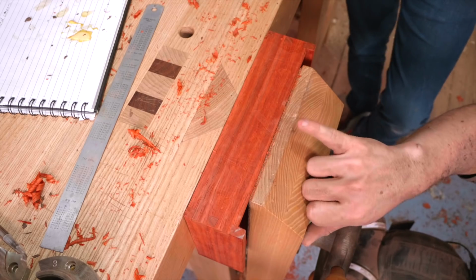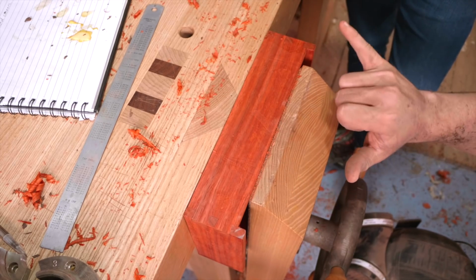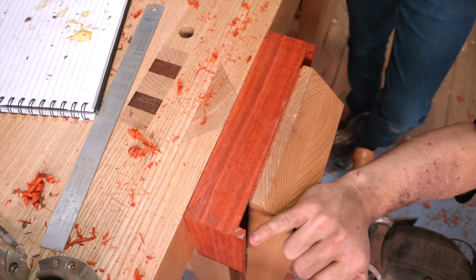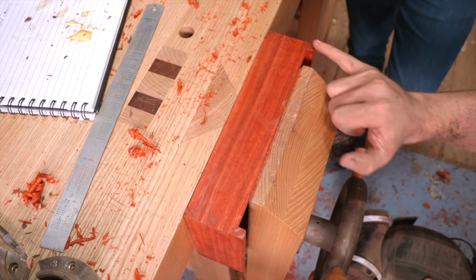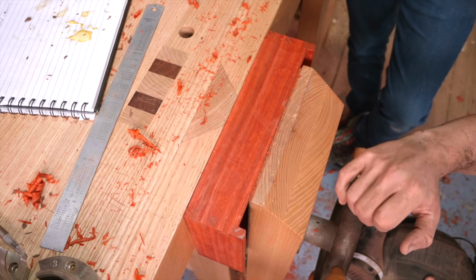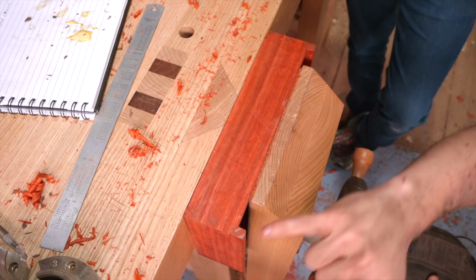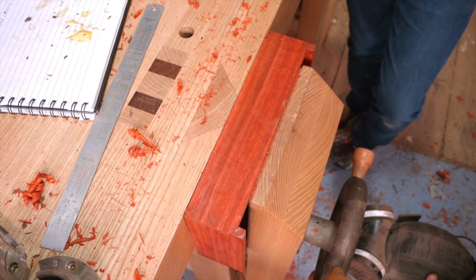If you can't reach the middle of that, it's because there's a high point there or there. Oh, okay. Which means you need to take those down before you get to the middle. If you try and bring the blade out in order to get to that, you end up cutting too deep and you end up chewing up this area and this area. I see.